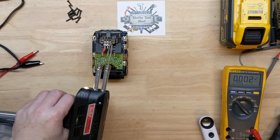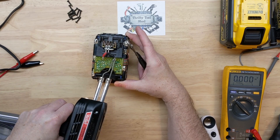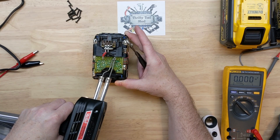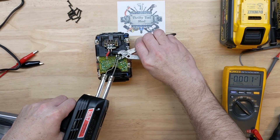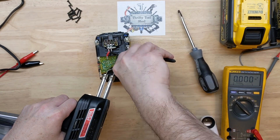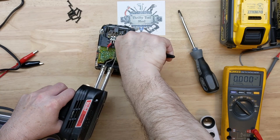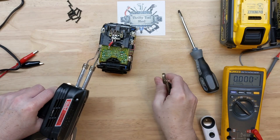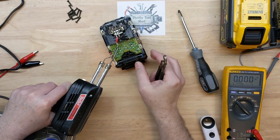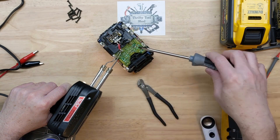The first thing I'm going to do is get my high-wattage soldering iron and take loose these spade push connectors. Once we get the solder to flow, we still just have to lift up enough for the connection itself to release. We'll do the same on both sides and speed the video up here so it isn't quite so long.